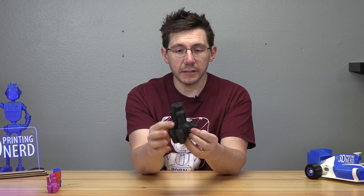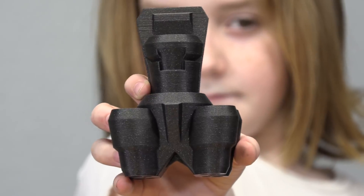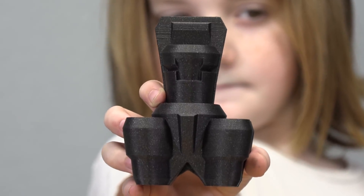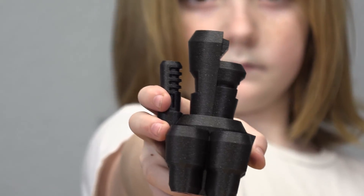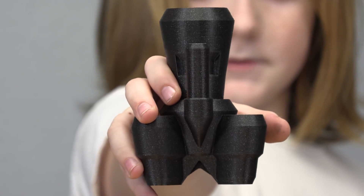At first I thought I'm going to use my Prusa i3 Mark III because it's here for review and I need to get a bunch of prints off of it. It still had that Prusa filament loaded on it. So as a test, I scaled up the spaceship 200% and printed it with the Prusa filament. The Prusa filament is quite amazing and this spaceship was glorious. Jeff actually put 3DPN at the front of the spaceship — really cool. The close-ups showcase what this filament can do. I printed at 0.15 millimeter layers using Prusa defaults within Prusa Control.